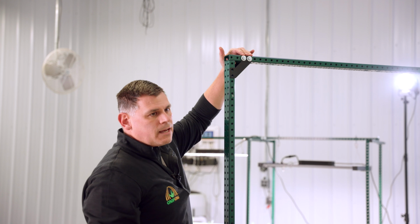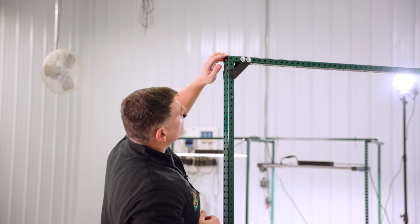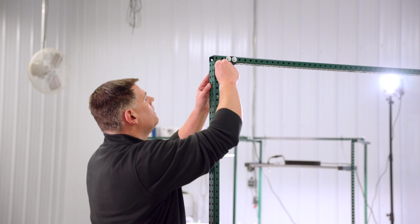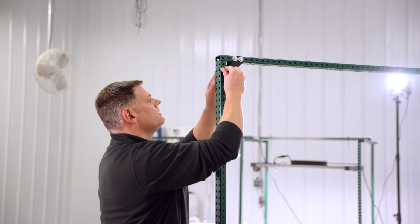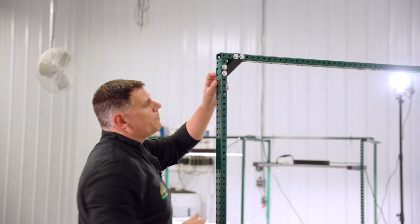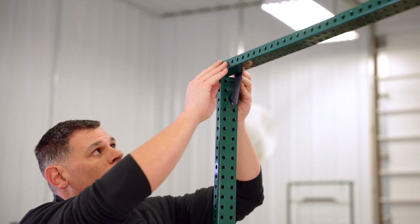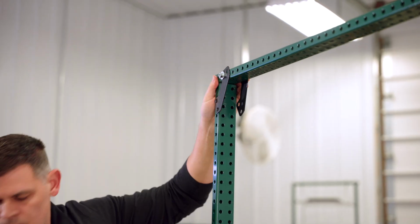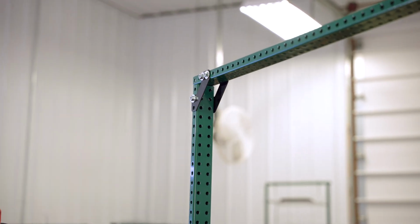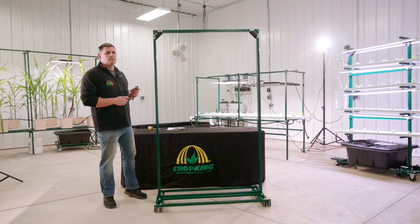If you installed the top of the gusset correctly, the holes on the vertical support should line up perfectly as well. But these are also holes number 2 and number 3 on the vertical support. A bolt with a washer, pass through both gussets, and then a washer and nut on the back side. You'll then want to repeat this exact same procedure on the far side of your unit. You can now use your ratchet and your wrench and tighten down the 4 bolts on each side.